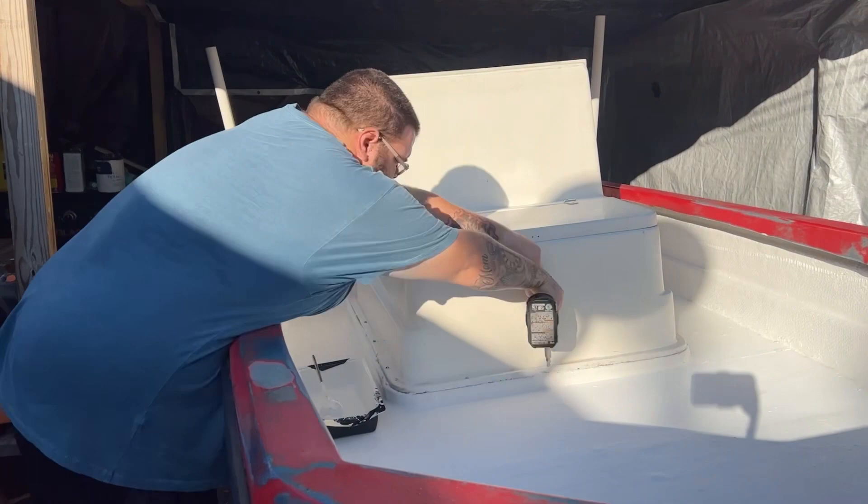Okay, I think that will be it for this week. We got as far as I wanted to - this is episode 10, took me 10 episodes to get to putting the actual console in there, which I'm very happy about. It's actually starting to look like a boat again. Next week we'll be painting the top cap - I'm going to work on that all week because it needs at least 12 to 16 hours between each coat. We'll also be putting in the steering cable, control cables, power cables, and all of that so we can put the decking on.